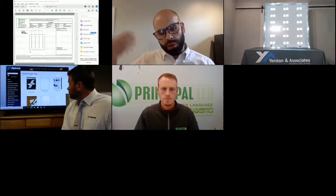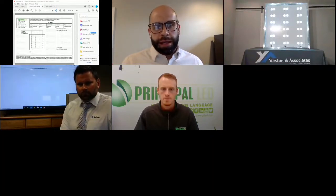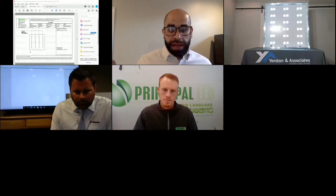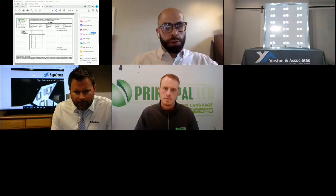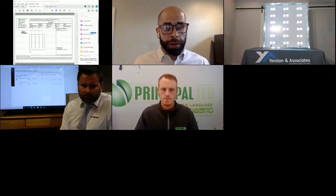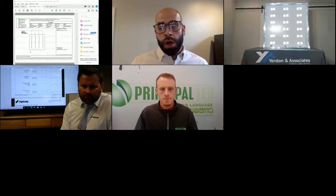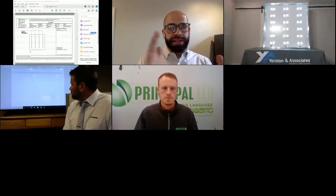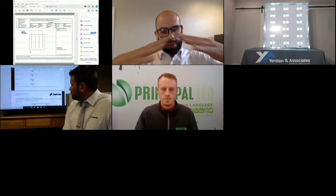So I wanted to show it real quick before I put the retainer back on, so you guys could see that sometimes we have to get a little creative here. We think, oh man, this is the way that we illuminate cabinets, right? You choose a row spacing and you just stick to that row spacing. In this particular scenario, with a 4 foot by 4 foot cabinet, if we did 12 inch on center, we're not able to move that frame brace out of the intersect. So we've got to make that gap a little bit larger so that we have that room.